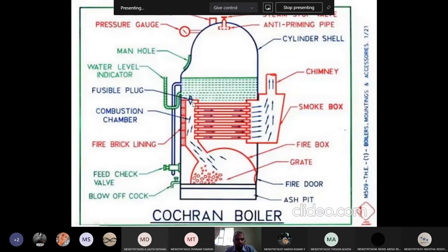We call it the combustion chamber. This is the fusible plug. The fusible plug means once the temperature exceeds the desired value — which would be very hazardous — the fusible plug will melt, so it will seize the fire. Directly from this, water enters into the grate, thereby the fire is seized. And there is the water level indicator and manhole. The manhole is a provision to enter a man inside the boiler for inspection when it is not in working condition.